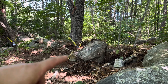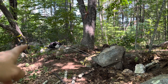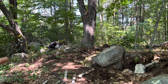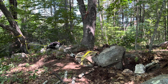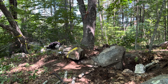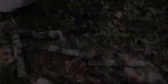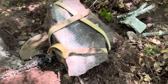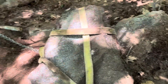Unfortunately, the boulder landed right on top of the pulley, so I'm going to have to try and jack it up and get the pulley out. Now the anchor is over here on this tree, comes back to a pulley on the stone, and then goes back to the tree and then another pulley and back to the truck on the winch. We got lucky with this one because it pulled sideways when we pulled out the other one. It had a lot of grippy corners — I could get this strap really well wrapped around it, so it should pull without slipping off.